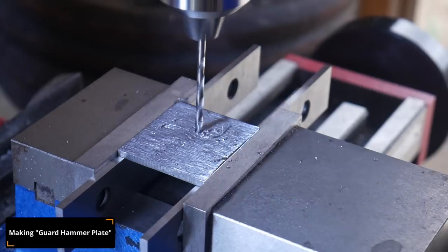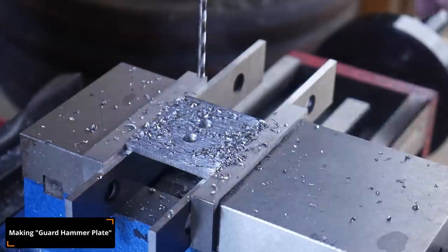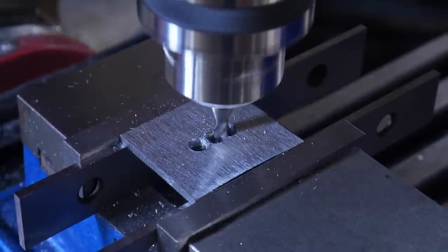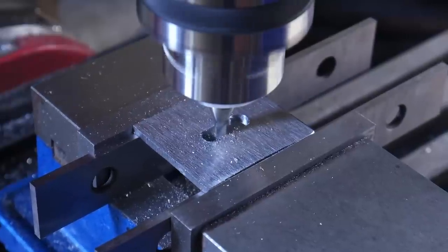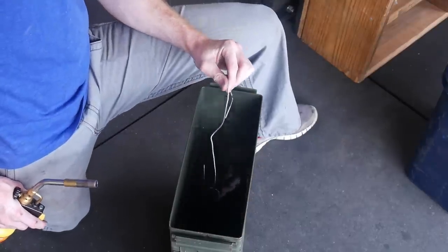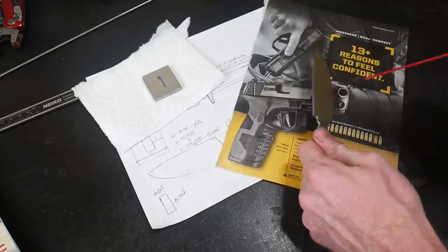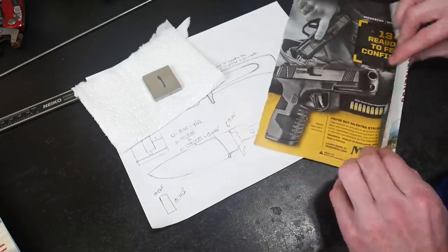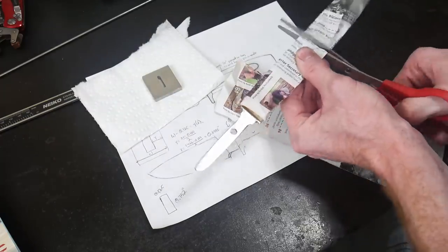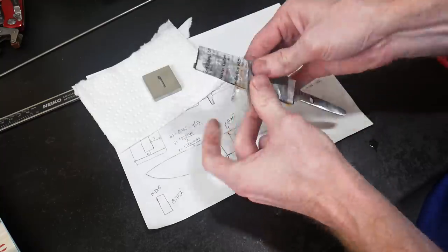In short order on the surface grinding attachment, I was able to erase our mishap on the vise, get the surfaces nice and flat again, and then I marked off the inside top of the guard to keep orientation consistent. I'm actually making a tool here — a piece of 1084 that I'm going to use as a backing plate to the guard so that I can hammer on it without worrying about messing up the guard's finish. I heat treated it and tempered it to straw so it's hard but still able to take hammer blows.